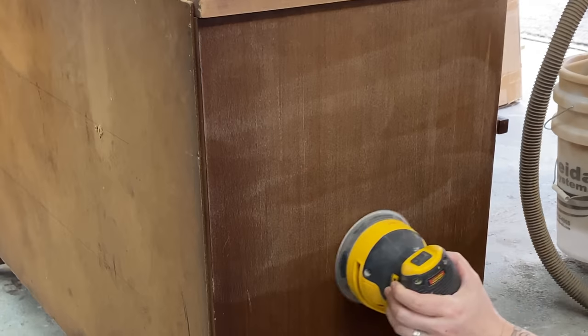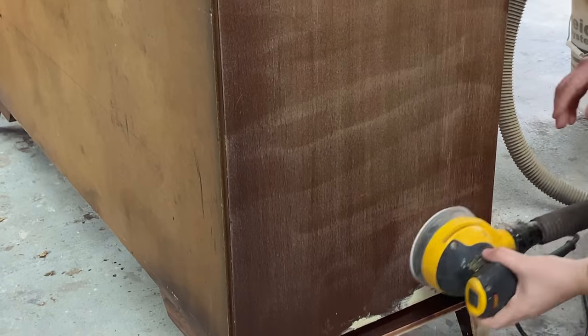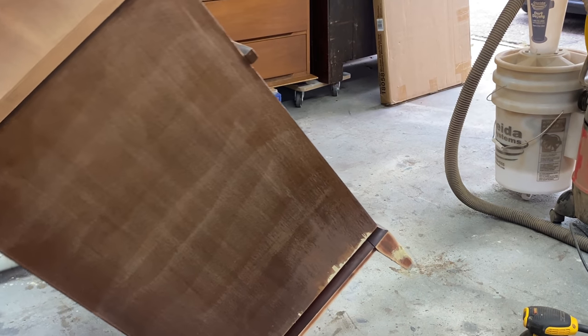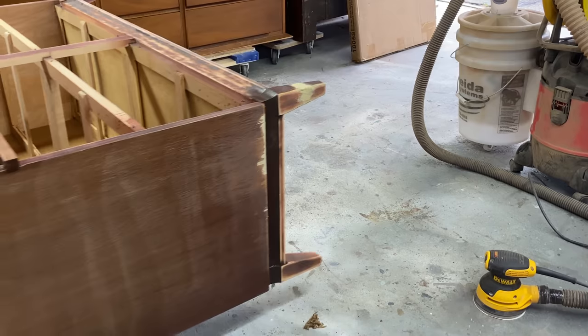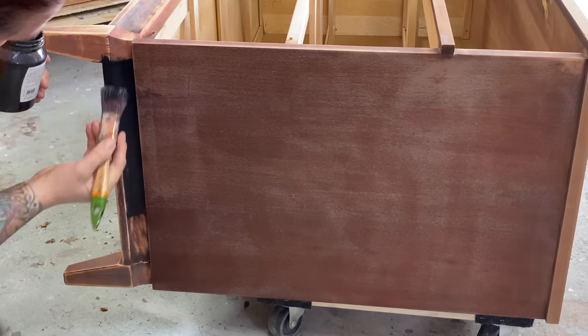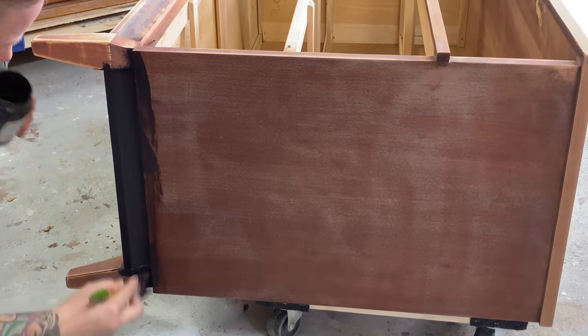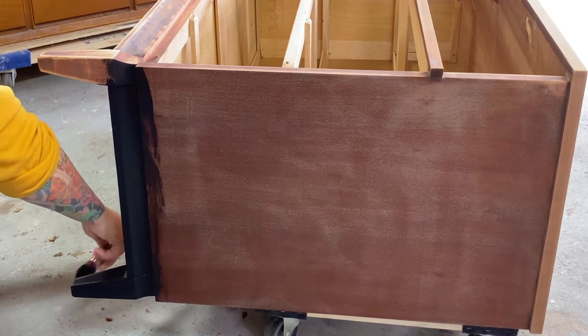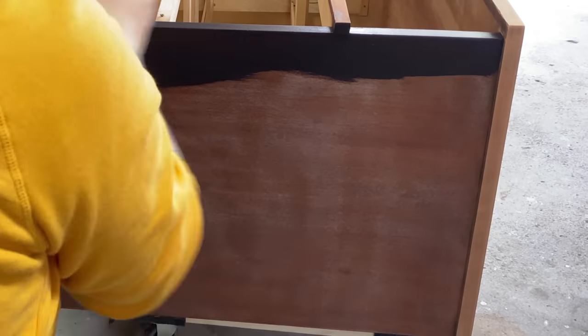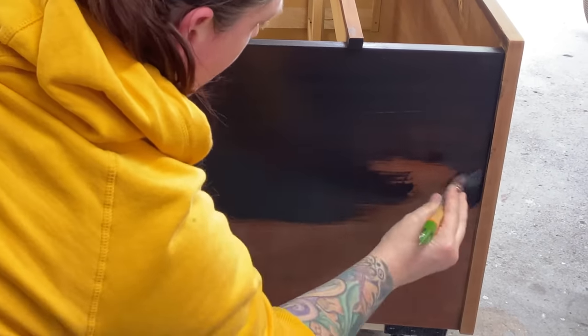Looking good — this top sanded up beautifully. I'm doing a little 180-grit scuff on the sides before painting, which is going to help the paint adhere and make sure the surface is smooth. I'm going to tip her over and see if we can sort out this foot — I had added some of the same wood filler to the missing veneer area, so I'm just going to sand it smooth and hopefully it will look like nothing ever happened. I'm using Fusion Mineral Paint in the color Coal Black — I'll link to it in the description. The first coats are always a little bit streaky; I'm going to be doing three coats on this piece.